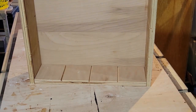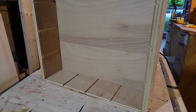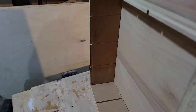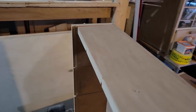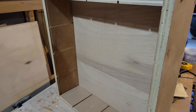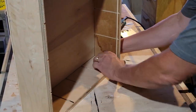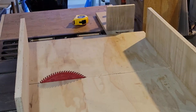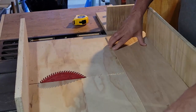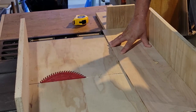This is the basics for the shell - that's all there is to it. I'll now show you how it all fits together as far as angles and everything, and then it's a matter of cutting all the individual dividers - there's going to be six of those. The front groove where the door slides down is nicely angled, just a shade about a sixteenth of an inch further out than the frame of the box, so it'll just slide down nicely. I ended up picking a different quarter-inch piece of plywood for this, so I widened that groove - again, part of the reason for not gluing everything initially, since some of my quarter-inch ply is ever so slightly different in size depending on the source.